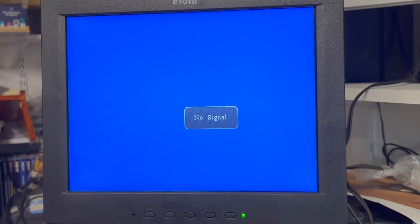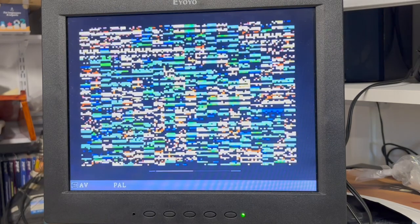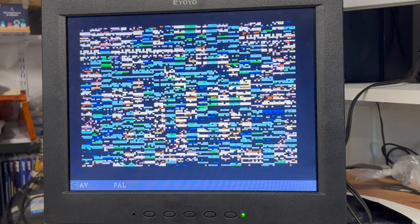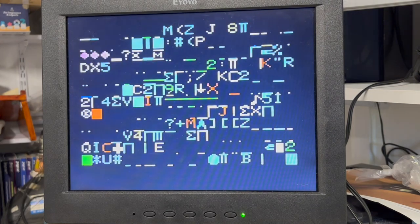Okay. Power on. Again, adjust the sync level. Turn it to the left, then turn it back to the right again. Interesting. Getting colour without chroma being... Okay. That's okay. Well, I'm getting colour. That display is looking a lot more stable, isn't it? Adjusting the video level.